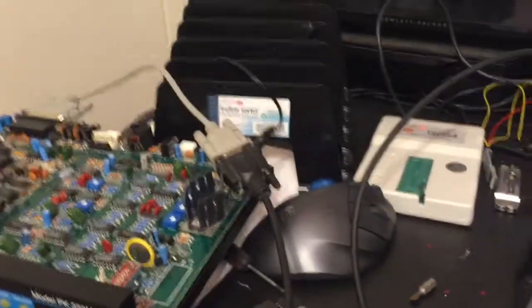This is the first power-on test connected to a computer. I've got PuTTY open and let's see if this thing does anything. Well, that was rather anticlimactic — absolutely nothing appears to be happening. So I'm going to check around the serial interface, do some studying of the schematic, and see if possibly I have a bad serial driver, or if we still have more major problems.